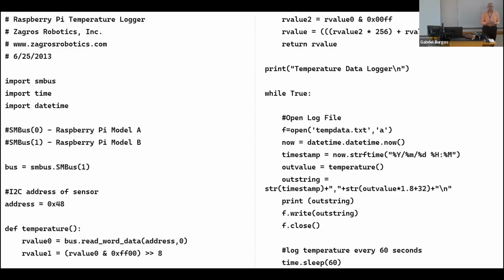Another thing you can do is to connect this to a Wi-Fi if you have it available, or a wired network available. That way, when you plug it in, it'll start up, it'll show up on the network. You can either use VNC, which gives you GUI access to it, or use a secure shell client to get there and start it up and then stop it when you want.